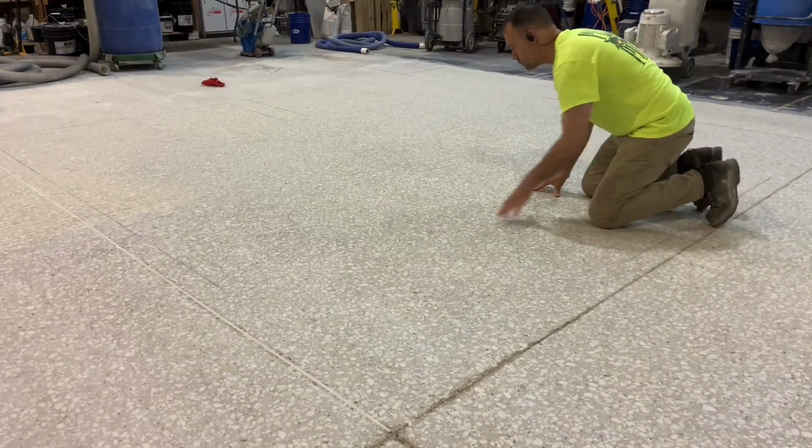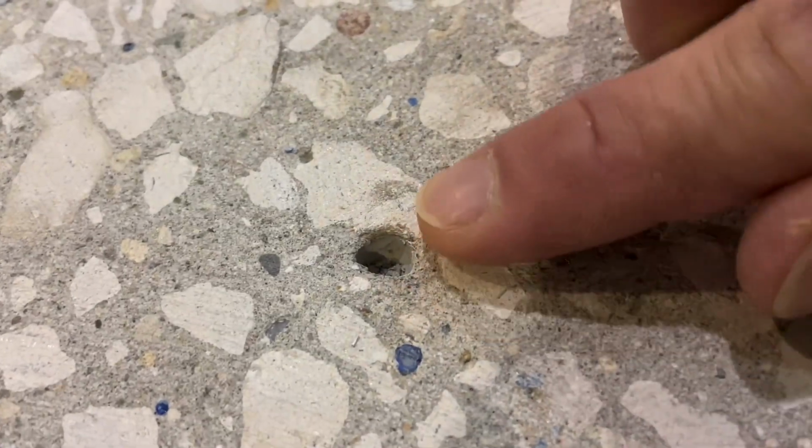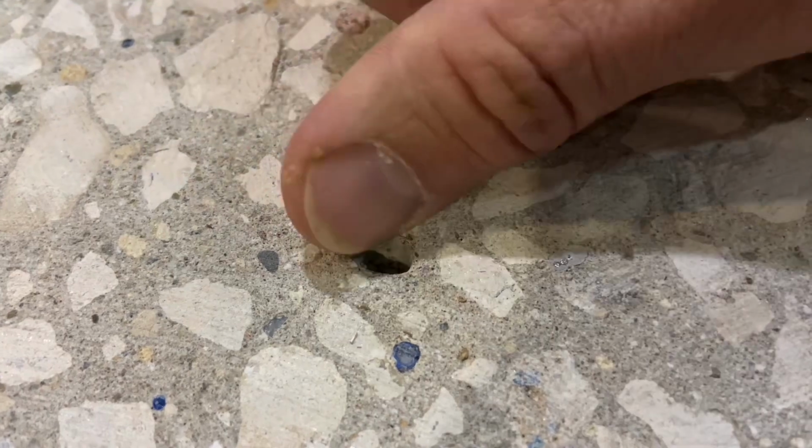Closer inspection of the surface reveals the extent of its porosity. Though unique to have a slab with this many voids, it is possible for old slabs to be this bad. The amount of surface porosity here dictates a pre-treatment primer coat.